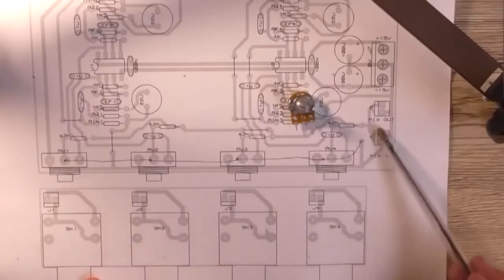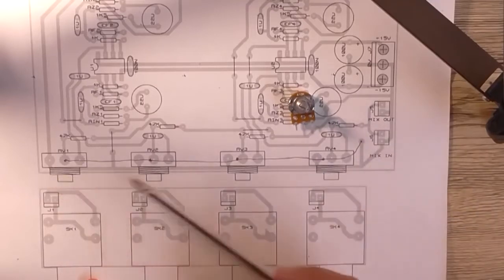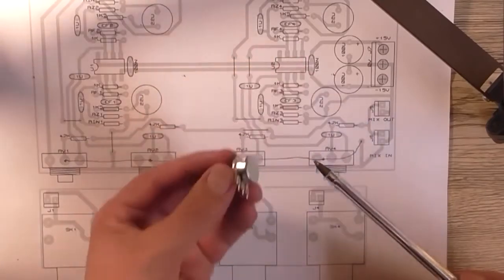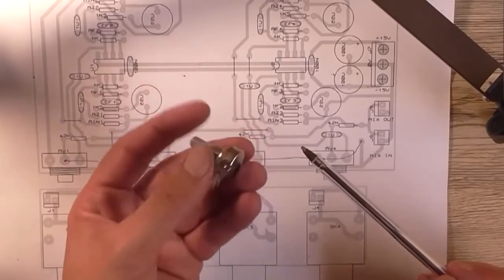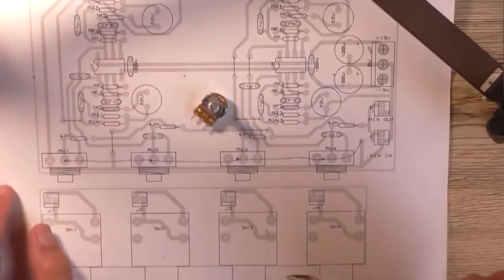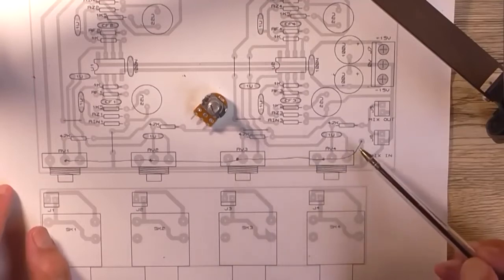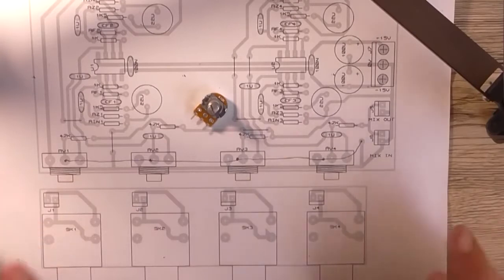So that wire is supposed to help with that. Firstly, it's physically connected to the ground point, and also the pots themselves would be grounded to the case via the front panel. But we're not relying directly on the front panel to ground the pots, because that may not provide a good ground point. There may be a slight resistance there, higher than 0 ohms. So this is what that wire is for, and you'll find it on a lot of circuits and in guitar amps and stuff like that. It's there for that very reason, to try and minimize the noise picked up by the shafts of the pots when you're actually touching them.